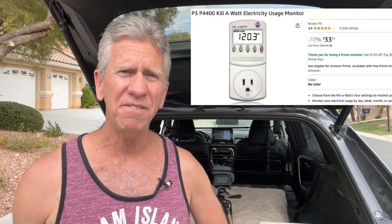For both the 120-volt and 12-volt systems, I'm basically going to look at energy consumption using the kilowatt device I have. I don't have a battery monitor but I think the kilowatt device will give us most of the information we need. We're going to start with the 120-volt systems — the big dogs in energy usage. I'll look at the microwave, then the heat pump, and finally the fridge. I've got a three-way fridge, so it does AC, DC, and propane, and we'll compare each mode.